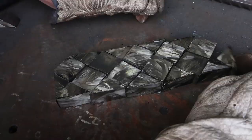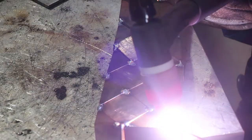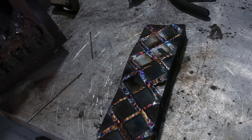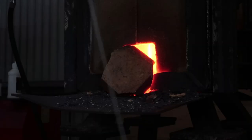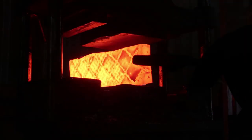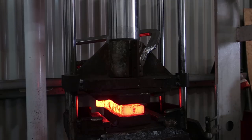We've now come to a point where this is the very last forge weld. When you come this far you want it done right — the very first and last welds always take the most time, but if you cut corners you're creating unnecessary problems. The way I'm doing this is by tying the billet rather than doing the fairy flip. Tying is the way I prefer — it's also easier and more versatile for me to form the pattern into diamond constructions, which I find more pleasing to the eye. It shows me doing maybe two to three forge welding heats but in reality I'm doing more like seven to ten. You want to go nice and easy pressure — go nice and easy, and when you're doing your last weld you want to make it right.